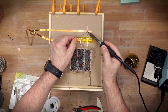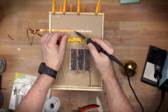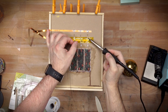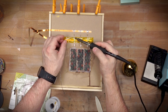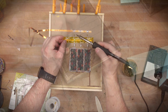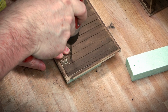And I'm going to start by soldering on the resistors. You should use an LED resistor calculator. I'll post one down in the description below to figure out what resistors to plug in here. This is basically a 5-volt circuit, so I ended up with 220 ohm resistors on this. But again, you should do your own calculations based on the LEDs that you're using. These were some warm white LEDs that I had kicking around.